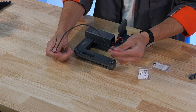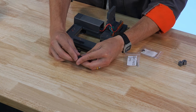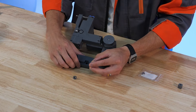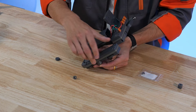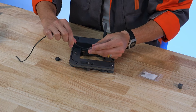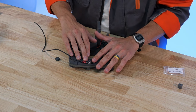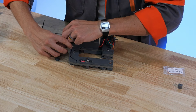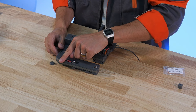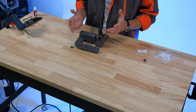We'll also need our cathode wire — this is what actually connects the tungsten carbide block into the EDM circuit. The two 3D printed components you'll need are the electrically isolating boss and the fastener cap. Take the tungsten carbide block and fastener and nest those together, then place them through the front side of the endoskeleton. Flip it over to the back side and install the fastener boss so it nests within the endoskeleton. Now that it's sitting flush, take the cathode wire, place that down on top, and install the nylock with a light installation first. Before torquing down, route the cathode wire through the wire routing on the back side of the tool up to your WAGO bus — or route it down through the bottom for a shorter electrical path from the wire tool to the twisted cables that provide power for the EDM setup. This will reduce EMI for our EDM process.